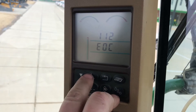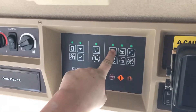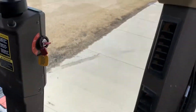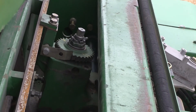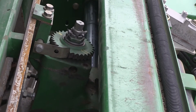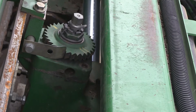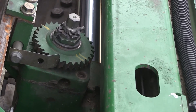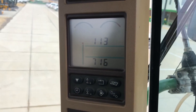Address 113 is going to be over on the right-hand side, approximately half on the knives and half off. I usually like to have that dog that catches the ratchet wheel about an inch away from the ratchet wheel. He's moving it across. There you can see the dog that's about to hit the ratchet wheel. Not too critical there — just hit enter, end of calibration.